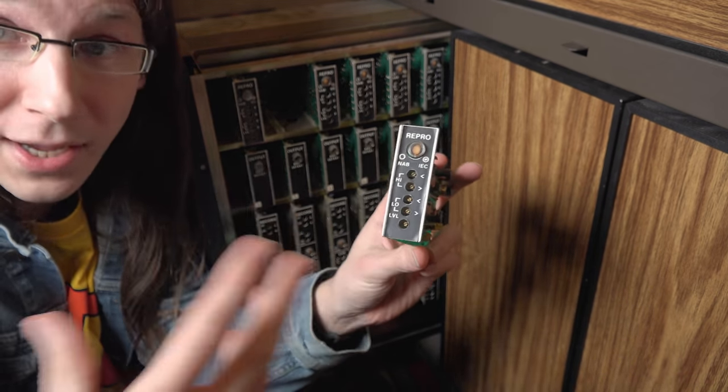The recording card has high and low speed frequency compensation, a level, and input calibration so it works with your setup. It also has a NAB/IEC switch and a reproduction alignment section for the cue head. The last card is the bias card. Bias — in German 'Vormagnetisierung' — is the amount of magnetism at the zero position. It's a critical part of the machine's sound: over-biasing causes distortion, and under-biasing causes a different kind of distortion.